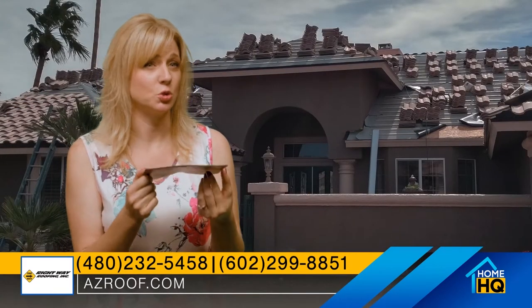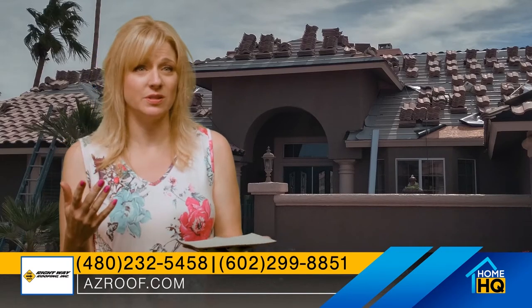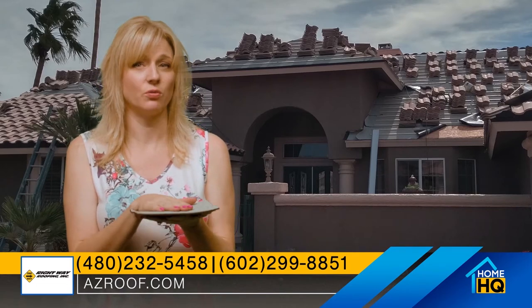This can be exposed to the sun for up to 12 years, so if you have a broken tile, a loose tile, or something you don't even see, it's fine with this underlayment. This is a rubberized modified granulated roof system that we're using as an underlayment on a tile roof.